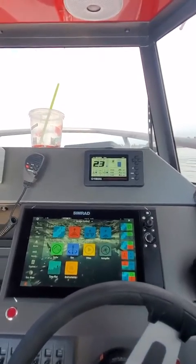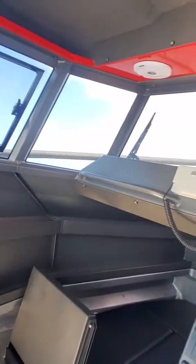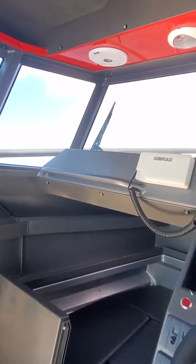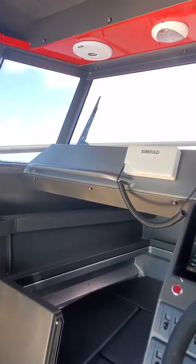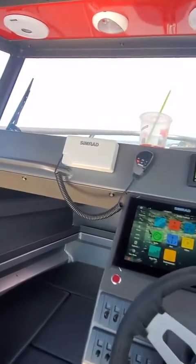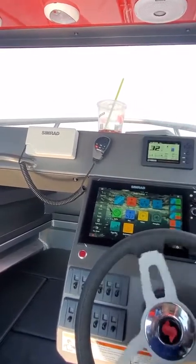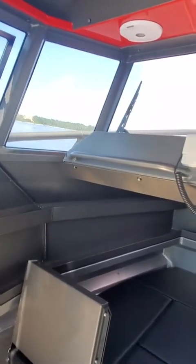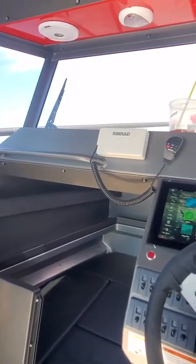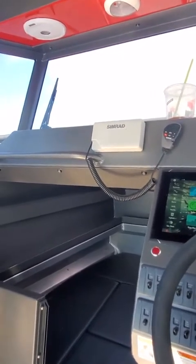It's going to come down and lean a little to that end. So say you're cruising right here — what I would do is probably put trim tabs on this. You got the room back there to do that. See, it's leaning right now. But once you let off the throttle you still got a little bit, but it settles down quite a bit. It's just when you're going up on plane — like right there — going up on plane like that. I'll pull the plugs when I get back.